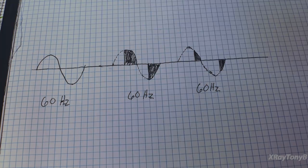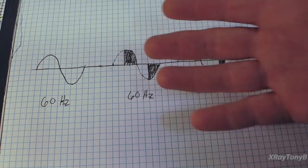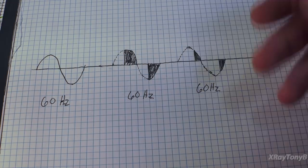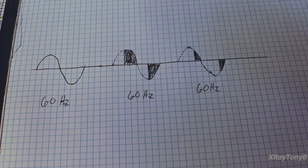Here's the caveat: the transformer is physically smaller than the amount of energy it actually needs to provide to the circuit - that's number one. Number two, it can output a higher voltage than the actual rail voltage of the amplifier. If we're looking for a 70-volt power supply and you just connected the transformer to mains, it would actually output more - like 80 or 90 volts. However, as soon as you connect a big load, it would saturate very easily because it isn't designed to deliver that kind of current. The way they get away with that is by using pulsed voltage.